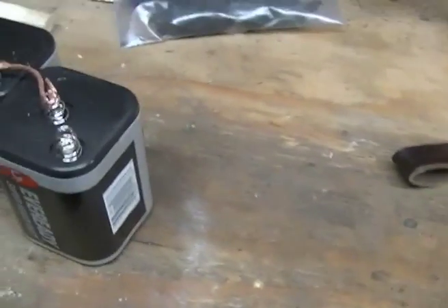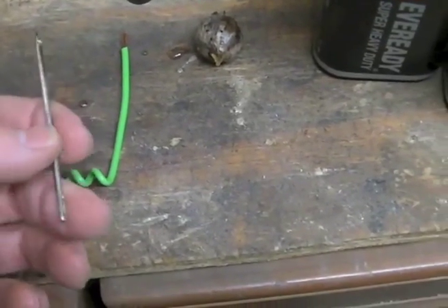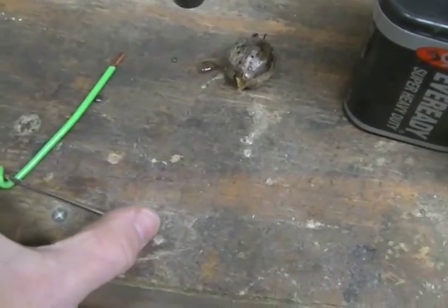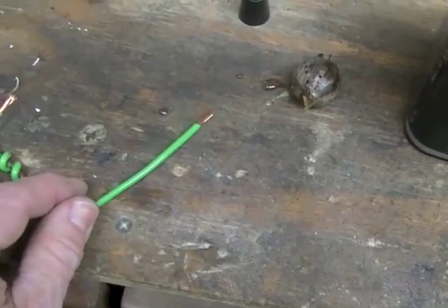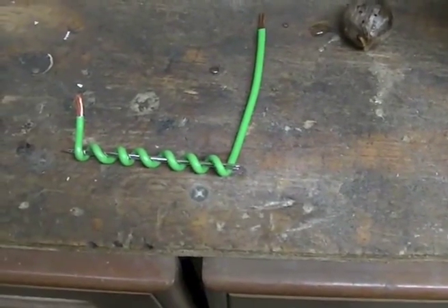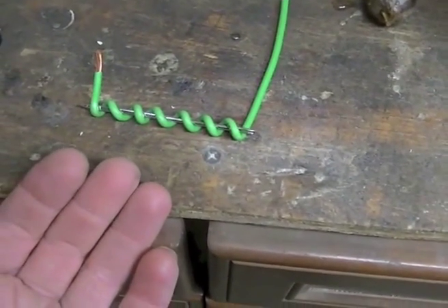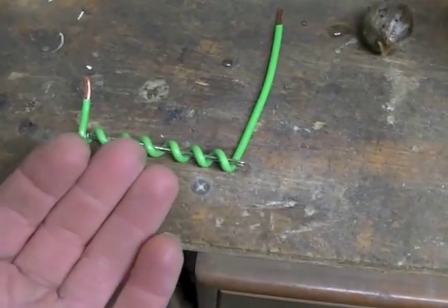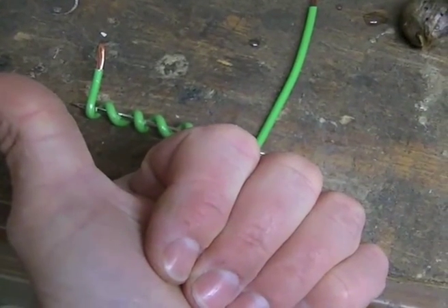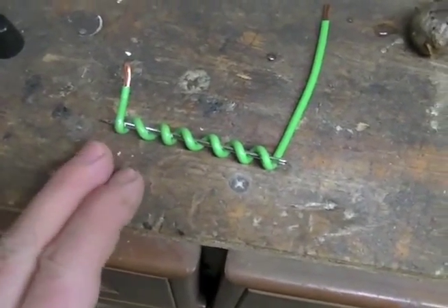Now I'm going to explain what I do. This needle has already been magnetized — I magnetize them all as soon as I get them. What I did is I took this needle and I wrapped insulated copper wire around it. That's real important. Now from what I remember from school, the direction of the current flow — you take your left hand, it's a variation of the left hand rule. Your fingers will point in the direction of the current flow, and then your thumb will point towards the north pole of your magnet. Without getting too technical, your thumb will point north.